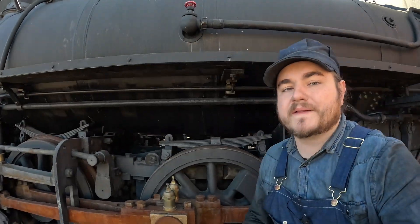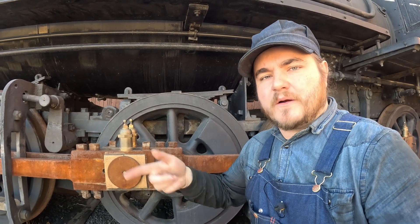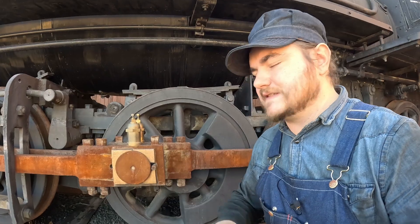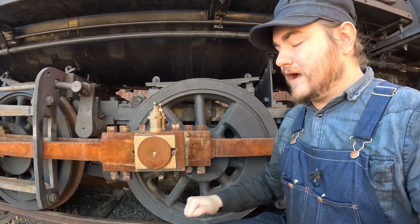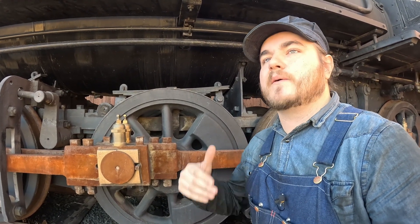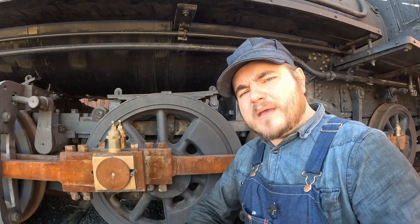Driver size has a lot to do with pulling power and pulling speed. Just like your car — if you spin the crank faster, however many RPMs your engine has times the transmission, you can spin the hub of the wheel at a certain RPM. And the bigger you make the wheel, the faster the car is going to go for that same RPM. So if you put bigger tires on your car, it's actually going to go faster than the speedometer says, if they're bigger than factory and you don't change the speedo. Same thing applies to a steam engine, although we don't have a transmission. The faster this main rod spins around and spins the wheels, times the bigger the wheel, the faster we go. In general, a locomotive with bigger drivers like 5629 is going to go faster than the 191. But that's not the whole story, and that's not why I wanted to make this video.